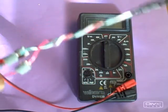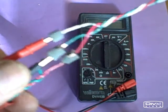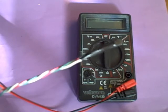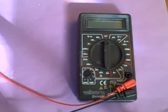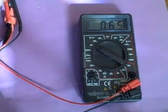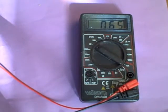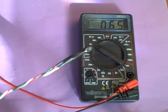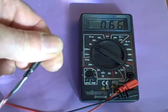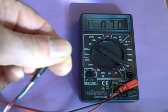We've connected our calibrated temperature probe to a power supply. One probe goes to ground, and the other probe goes to the output of the calibrated probe. This is made from an LM34. The first thing we'll need to do is set our DVM to read voltage. Right now it's reading 0.65 volts, which represents a temperature of 65 degrees Fahrenheit. If we add a little heat to the probe — putting my thumb on here — it's up to 0.68 or so, about 70 degrees right now.